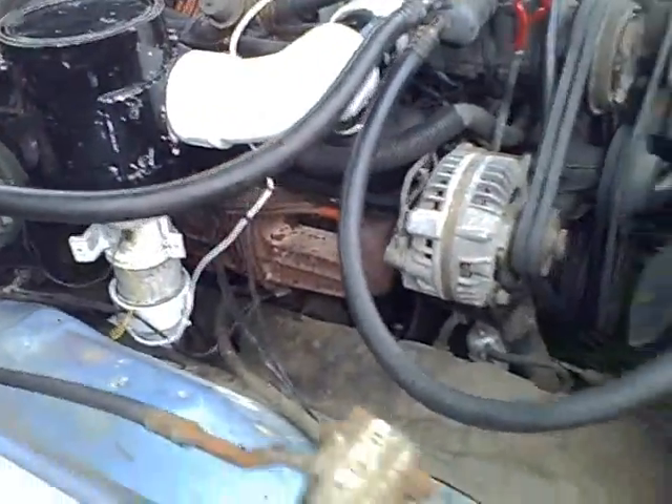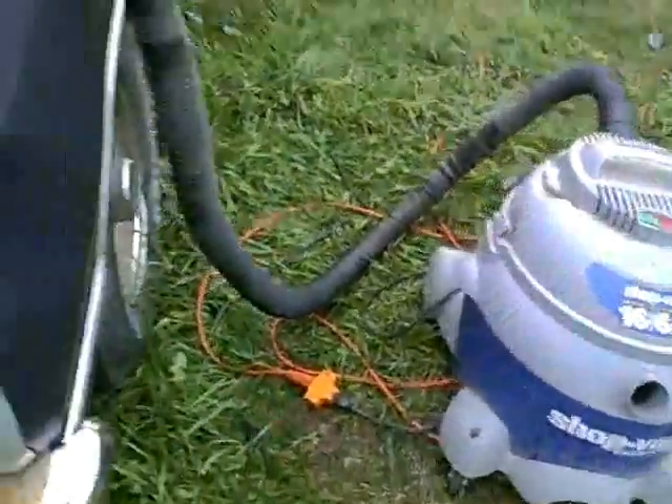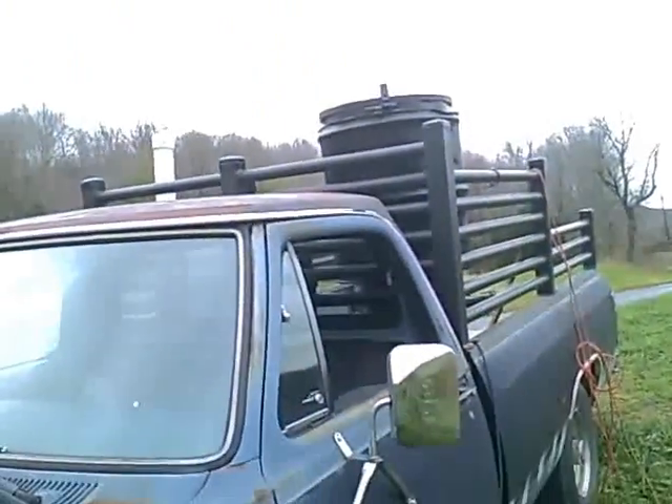I'm going to stop it real quick, and then I'll show you with the leak bottle, but there's really not that many leaks here. We're going to back-feed the system now with pressurized air from a shop vac. It's really best not to do this while the gasifier is still lit, but it's blowing backwards anyway. So you'll see some extra smoke come out when I start this up.